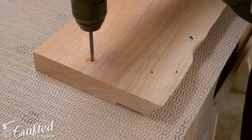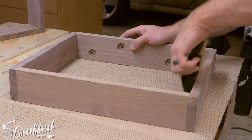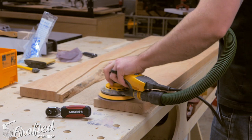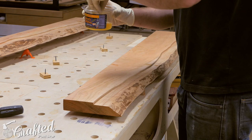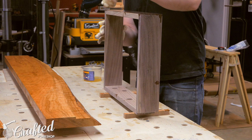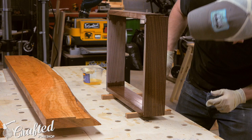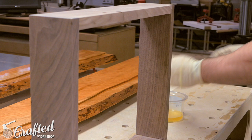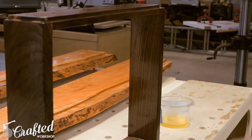All that was left before finishing was a final sanding. I brought all the pieces up to 180 grit using my random orbit sander and broke all the edges using a hand sander — I just wanted to keep them from being too sharp. For the finish, I decided to try Minwax Wipe On Poly, a finish I'd never tried before but that's super popular in the fine woodworking segment. It was really simple to apply — just wiped on a coat using a cotton rag, let it dry for a few hours, sanded lightly with 320 grit, wiped off the dust, and repeated this process four or five times. The finish turned out really nice — a perfect satin finish — and I'll definitely be using this again.